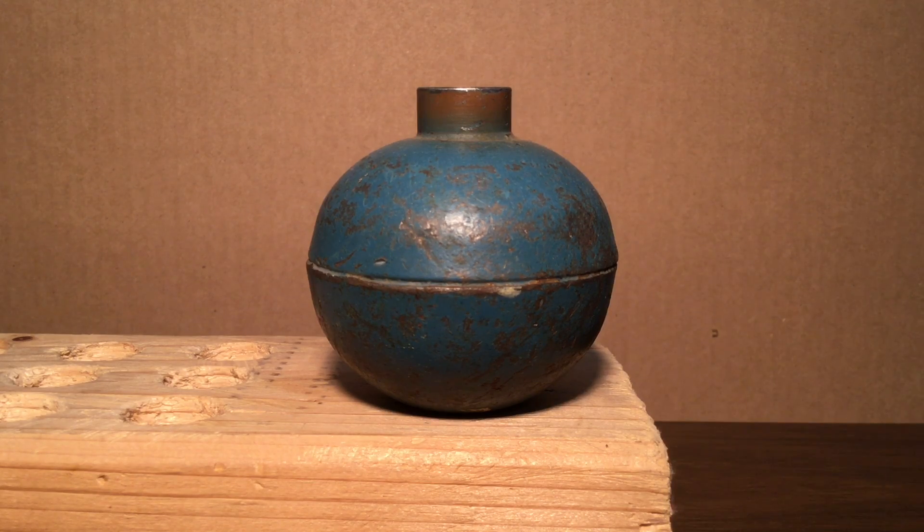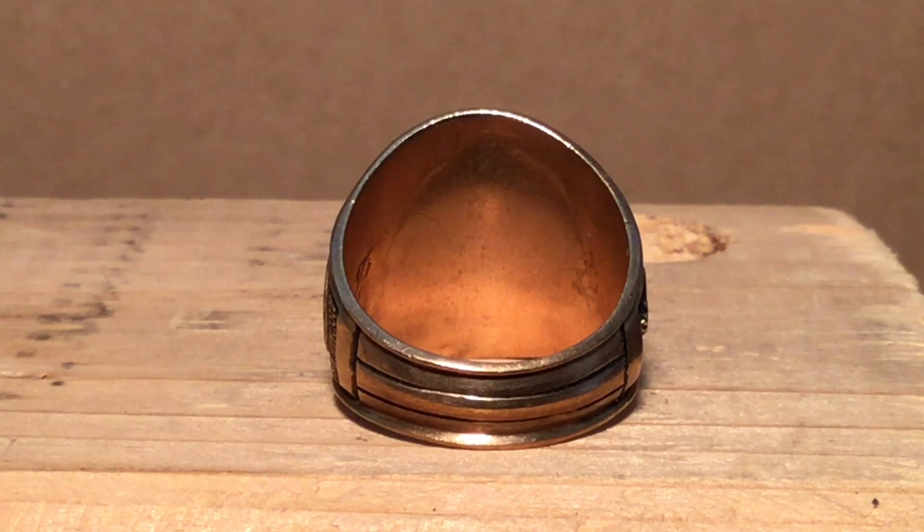Gold would be a very good material for bullets because it's very dense — twice as dense as lead and over twice as dense as iron, at 19 grams per cubic centimeter. The Brinell hardness of gold is 188 on the mega-Pascal scale, which is softer than iron and soft enough for bullet metal. The melting point is 1,947 degrees, but alloying gold with silver can bring that down into the 900-degree range so casting is possible. The problem with gold is simply the high cost.